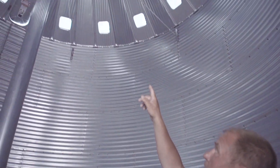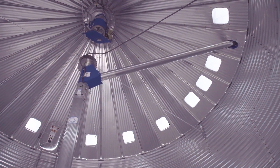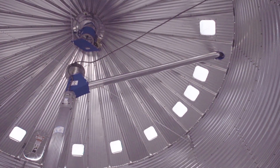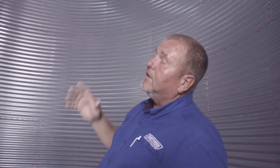The other thing we want to look at is up on top, in the flighting going across to the transfer augers. There's a cover on the back side of the box — we want to pull that off and look at the excessive wear on the augers. If it's starting to get sharp or the flighting is coming loose from the tube, we want to go ahead and replace that flighting. While you're up there, there's also a bearing at the top that needs to be greased — give that a couple shots of grease.